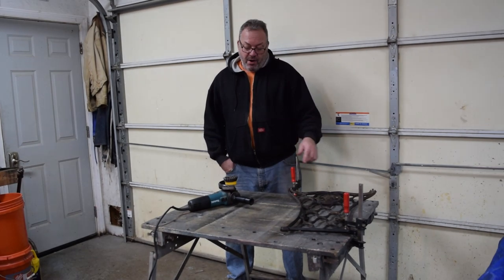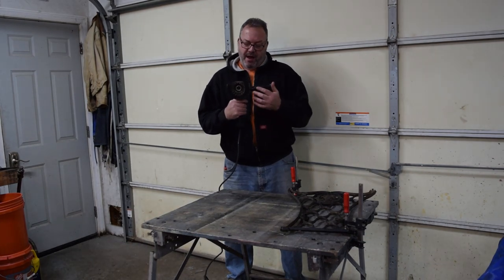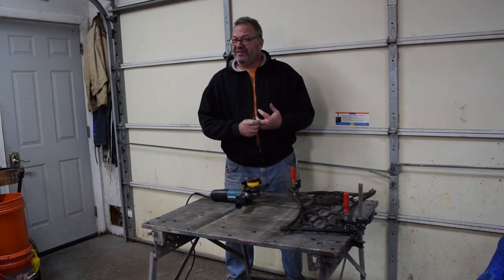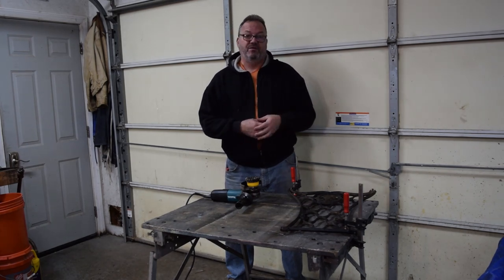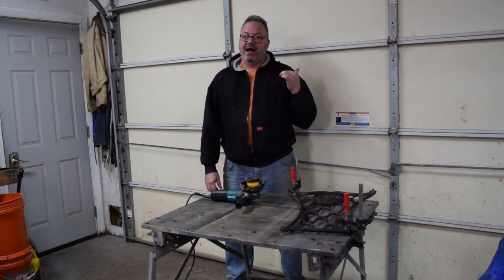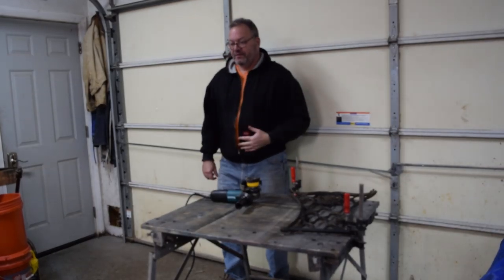But anyways, what we're going to do is I have a braided wire brush cup on my grinder, and we'll use that to take the paint off. If you have access to a blast cabinet, that's the way to go, but I don't, so I elect to use the wire wheel. So it's a very cold, rainy day out today. I'm gonna be ducking back in and out of the shop, but I'll get you out there, show you a little bit of what I'm doing, and then I'll get to it, so stay with us.